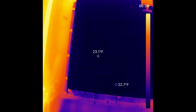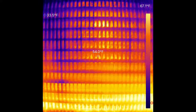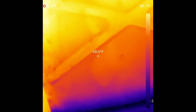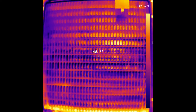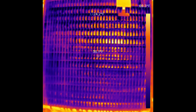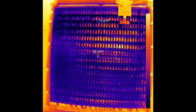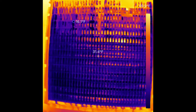Now, the one thing I did notice with the old FLIR, and I'll have to find some old video on my channel, is I think you could see the penetration, you can see the pipes better. Like it penetrated more. This one, I don't know if it has the ability to do that as good as the other ones. But you can definitely see the tubing behind the evaporator there. Did you see that? You can see where it's all cold. And you can see the tubing behind the evaporator on that shot. So this one's pretty good. The Topdon TC002 for iOS. They also have it for Android. But this ice maker is back together, and I'm pretty stoked on it.